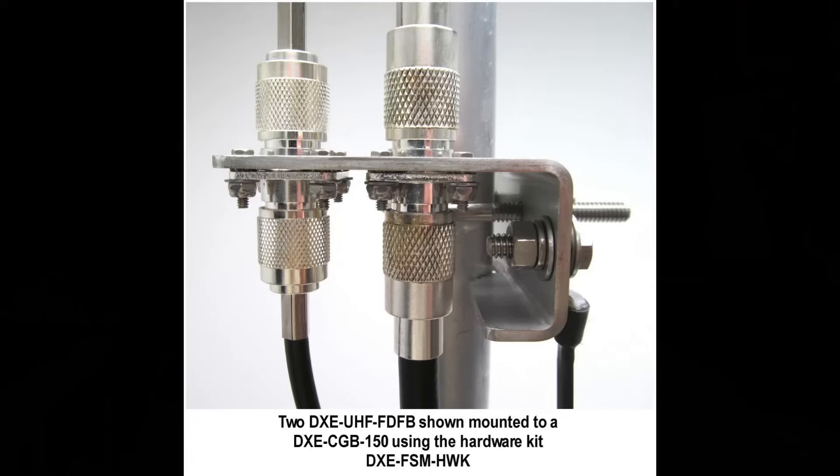I would recommend, if you're going to put something up there, put a regular J-pole and mount it on top of the tower, so it's just the J-pole from there on up. Most people feed J-poles just with coax. You're going to run that coax down to the bottom of your tower, where there should be a connection between the coax shield and the tower at the base — the tower is grounded with ground rods there.